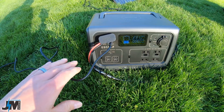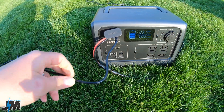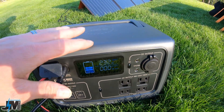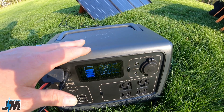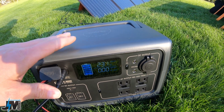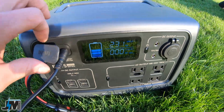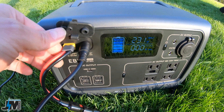I'm getting about 205 from the AC charger and another 26 from solar, so that ought to charge it pretty quickly. On a bright sunny day that should be up in the 300-and-some watt range, because I usually get 100-and-some watts out of these panels when they're paralleled together when the sun's high in the sky and no clouds.